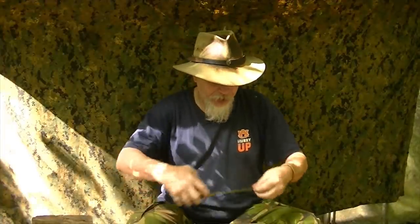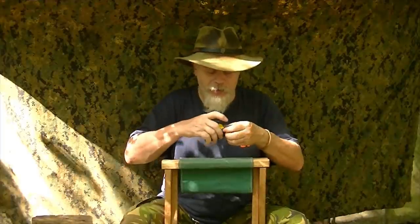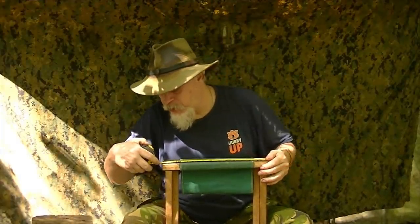What you're going to do is you're going to need a tape measure, and you need to figure out how wide the top of your stool is — how big from here to here on the outside edge. Give yourself a little bit of room. So if it's exactly 12 inches, give yourself 12 inches and an eighth. That's going to be important. This particular stool is 14 inches, so I would make the opening 14 and an eighth or 14 and a quarter.